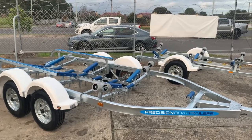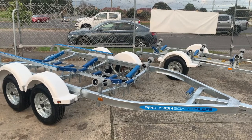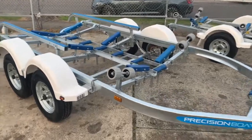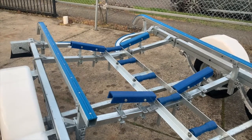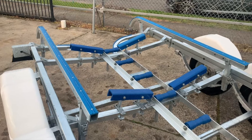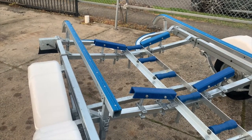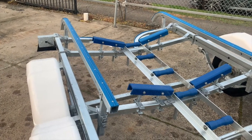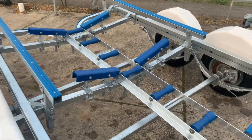This trailer we've got here is the tandem 560 brake setup for an aluminium boat. It's a drive-on drive-off trailer with side skids on either side of the rollers to make sure the boat self-centres. If you look down the back, there are very heavy duty trailer mounts so they don't bend or break. Look at the amount of rollers up the keel — it's fantastic.